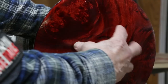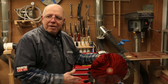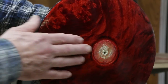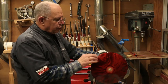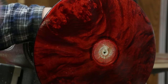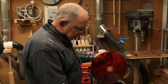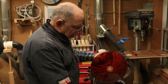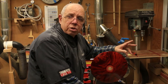The other thing is: I'll hollow out the center, but I wait and do that after I've got all my finish done. That way I'm not coming back, because you have to be very careful on some of these pieces — especially if it's a curved piece or has a corner — it's very easy to sand through your cover and your finish. So what I do is start out with 400 wet/dry sandpaper, which you can get at an automotive store, Lowe's, or Home Depot.